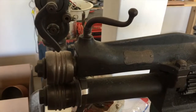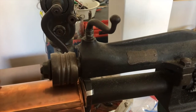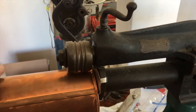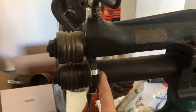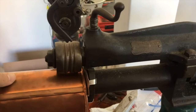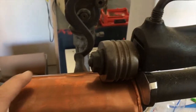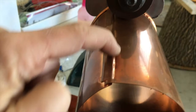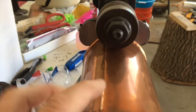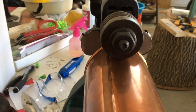What you're going to do — and I'm going to try and do this one-handed, which is always a feat — you're going to put your piece wherever you want it. This can be slid all up and down this shaft so you can get a piece pretty deep on here. I've cranked it down so now it's sitting in there. Something else to be aware of: see the crimp seam here? You want to watch it so that when you run these through, you're starting in an area where you're not going to disrupt that seam.